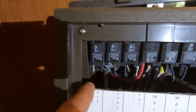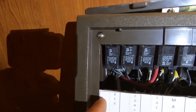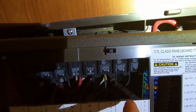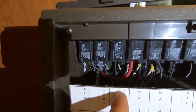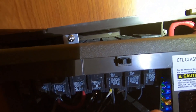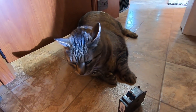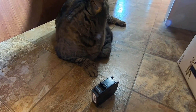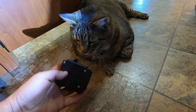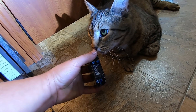We're going to be changing this around. This is going to be a double breaker here, so we're going to be putting GFI and bedroom on here. We're going to move the microwave from line two over to line one. We're going to be eliminating that and leaving this one. Rear AC is what's going to be here on line two. Jackson's over here - he brought me the breaker, appreciate it Jax, I needed that double breaker.